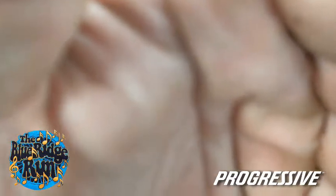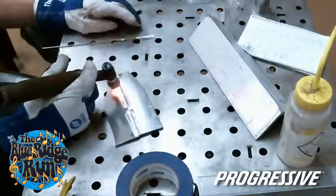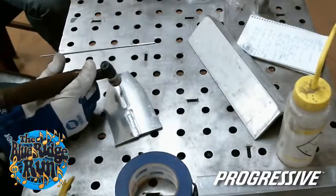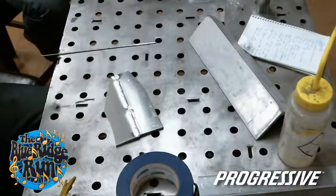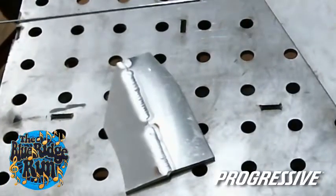And it's nice because you're seeing two different people's techniques, two different people's finished product. And with aluminum, you want to kind of swirl it, or you'll get the same thing as with the stainless, a fisheye. You'll swirl the weld and dab maybe one or two dabs at the end as you taper off slowly. But in all reality, consistent. I think Brian's are better, probably.